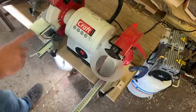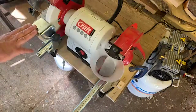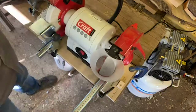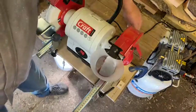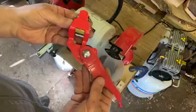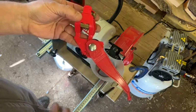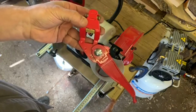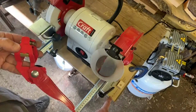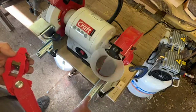Perfect position, Charlie. Now on this one, I've got two jigs set up. We've got a flat plate jig, so again, the woodcut product here, and then we've got the true grind. True grinds are ever so simple, very much like the one that I've just been using. That's the true grind system. I'm using a slightly different recipe on this one. And again, I've marked everything so I remember, and so the students remember. 60 mil protrusion, so instead of 65 that I was just using, I'm using 60 mil. And I'm using 100 mil protrusion here.